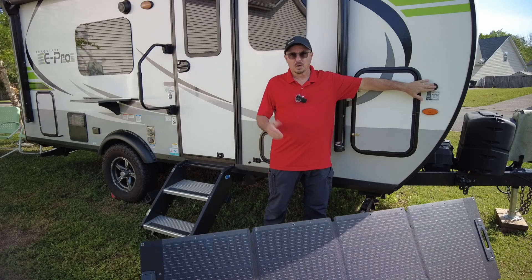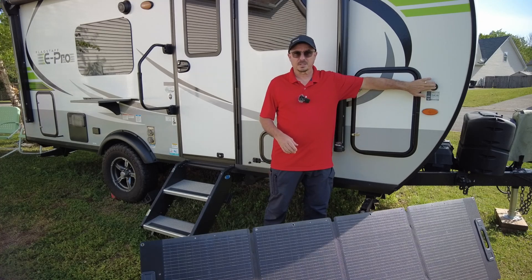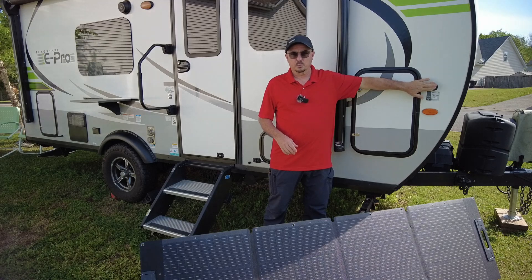If I want to plug an air compressor in, or even plug a radio in and run it from the outside, I can do that with this port. So now with the addition of that panel fed into the solar-on-the-side port, I've got almost 600 watts of solar power on the RV. I probably need to upgrade the battery next. The nice thing about having that portable solar-on-the-side panel is that even if we're parked in the shade to keep the RV cooler in the summer, I can pull that 200-watt panel out into the sun and collect 200 watts of solar while still keeping the RV cooler utilizing that shade.